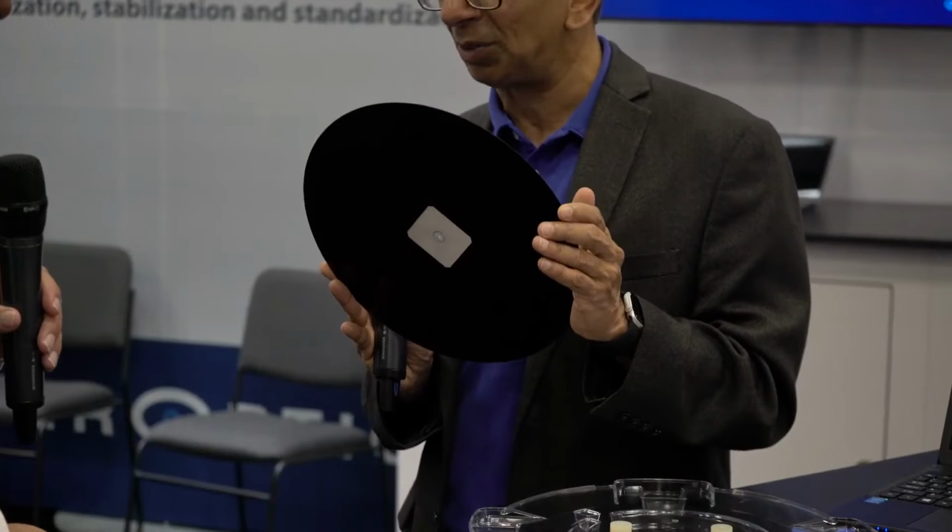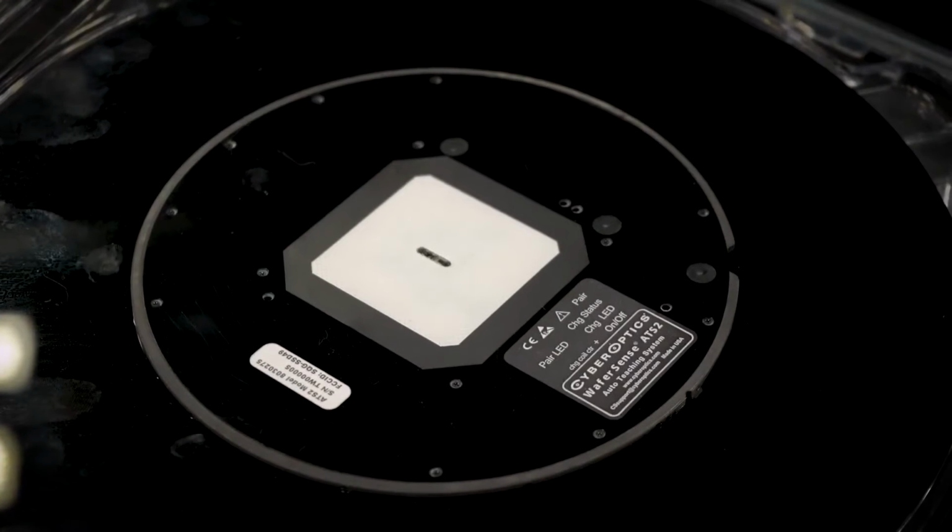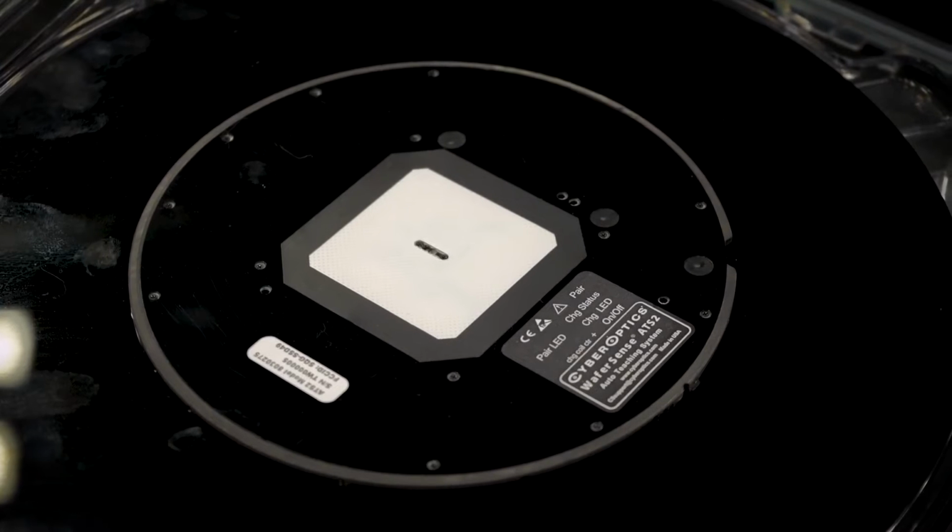So it looks like a wafer, feels like a wafer, same height, same weight, same dimensions, but it's a silicon carbide substrate with cameras, Bluetooth or Wi-Fi, and a lithium-ion battery. We can go wirelessly on the robotic arm and find out exactly where the robot is, so it can do the teaching. The dimensional data that this is giving to the robot, what accuracy is that working to? Very, very tight accuracy, and in the spec sheet we go into that, but we are down in the micron range. We teach the robot exactly where it is to a few microns of accuracy, which is good enough for that particular application.